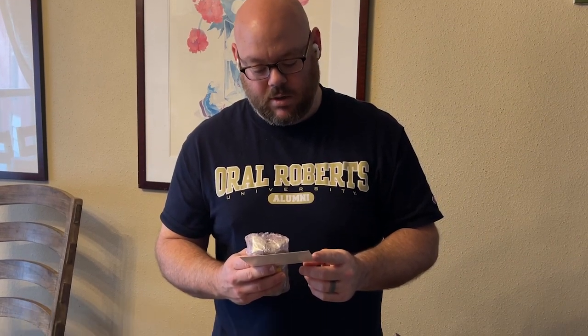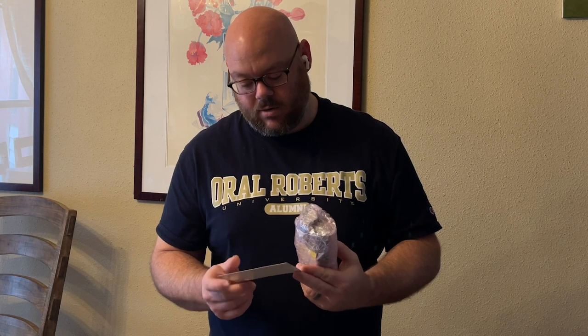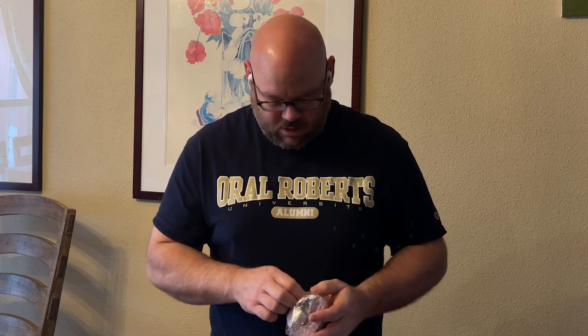So you get the box, an important thing. Only hold your TaylorSense battery box by the plastic body. Avoid touching the circuit board. You don't want electrostatic damaging it. Before installation, ensure all the TaylorSense sensors are working properly. Do this: insert a 9-volt battery in the TaylorSense battery box while looking at the bottom of the circuit board to see if you see a red light blinking. And then there's instructions online. Or you can watch this video.